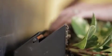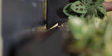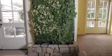The Bright Green panels have been designed around a drip system. At the top of the panel is a water reservoir. There is a notch in the panel which the drip line can snap into. As part of the Bright Green panel design, all the water will flow from panel to panel and end up in the drainage trough below.